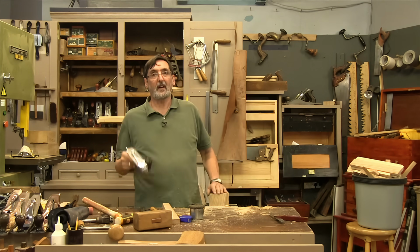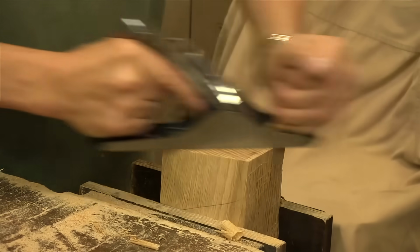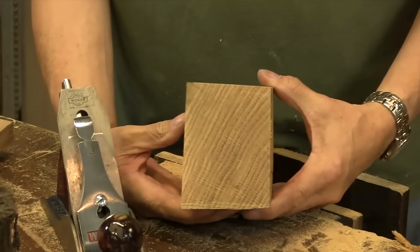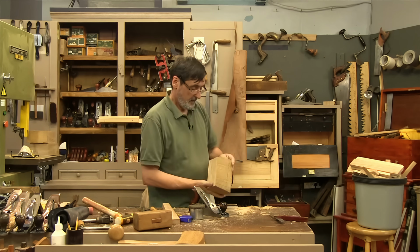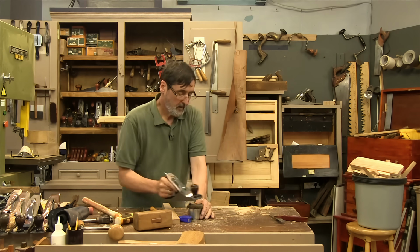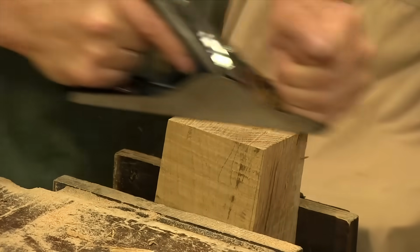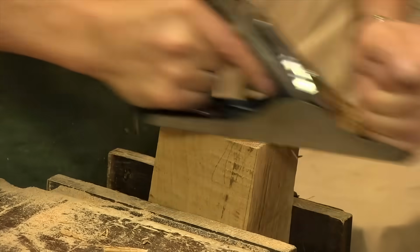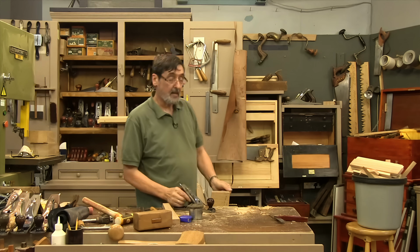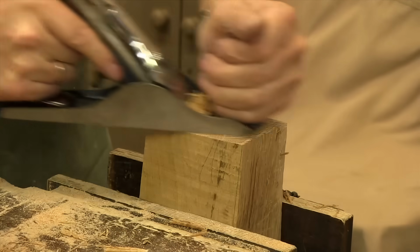You don't need a block plane for end grain. This, number 4, is perfect. That Leonard Bailey, he knew his onions when it came to bench planes. That's my end grain planed on one end. Same on this end here. Actually, my cut was better from my bow saw than it was from the bandsaw. But that's because I had a pretty aggressive bandsaw blade in, which I use a lot because it cuts so efficiently.